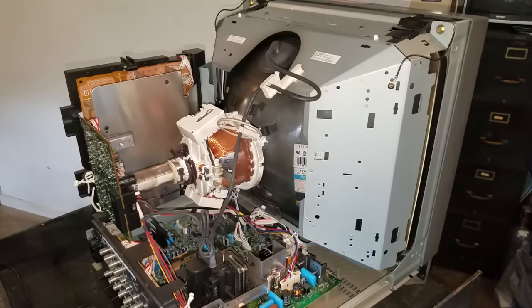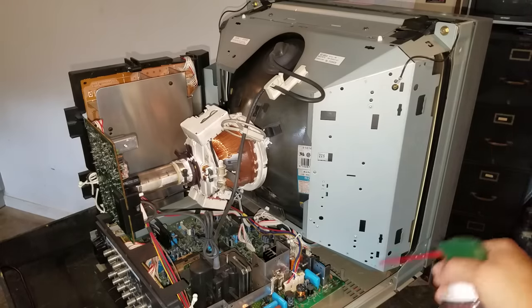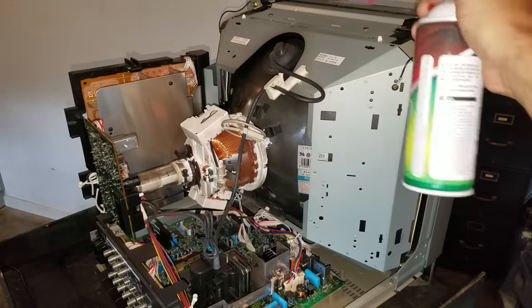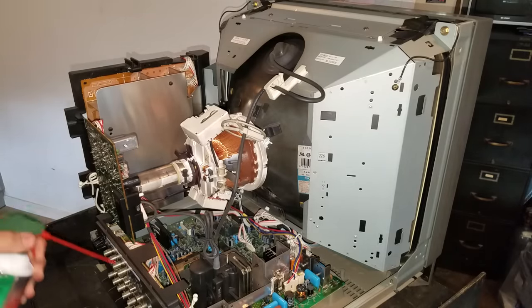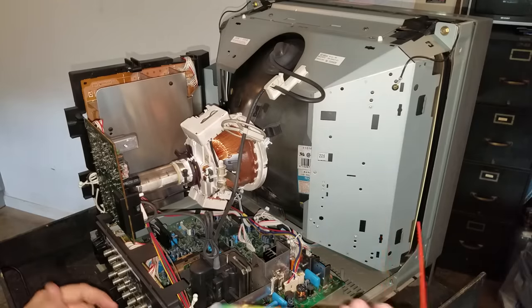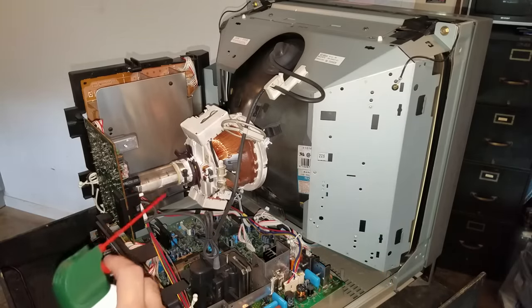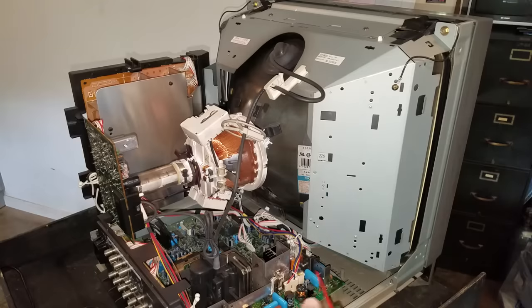There you go — maybe you can see it's already getting a little bit better. You've got some dust flying around in the air on the lens, so I'm just going to blow a lot of this out now. Just in case you don't use compressed air very much — just do slow, sporadic bursts. Slow bursts most of the time. You don't want to shoot out a lot of that cold onto your board and your other components, but if you just give it some quick bursts it does great.